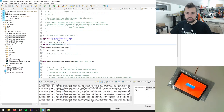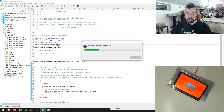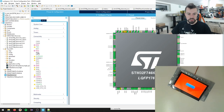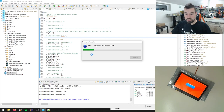We also haven't initialized our I2C. We need to go into the IOC file - I2C3 is the one we're looking for. It's asking for an external I2C handle type definition for I2C3. Let's add that: go to Connectivity, I2C3, set it up as I2C mode, press Ctrl+S to save and regenerate code. We might get lucky.